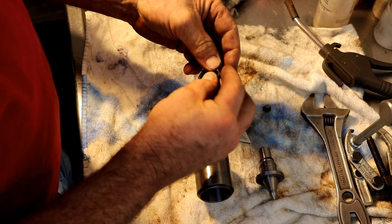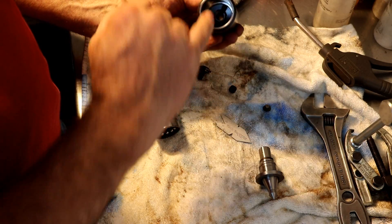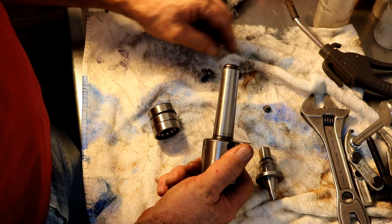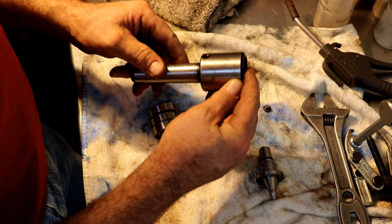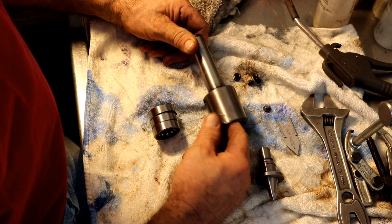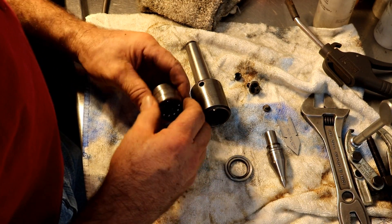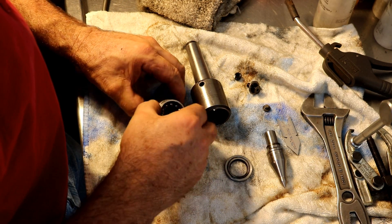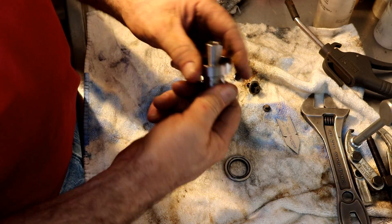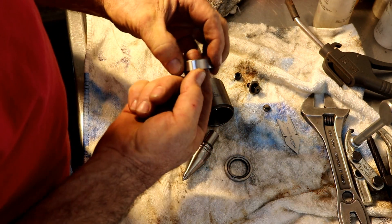The oil was probably leaking out — that's probably why there's Teflon tape on there. This is an oil-filled unit and there's a hole all the way through, so the oil could easily leak out of that plug. We'll put Teflon tape back on there. It's a Royal center — pretty simple, very nice. I got it on eBay through a make-an-offer and they took my offer, pretty decent. The bearings I cleaned up are in fairly good shape really. We're just going to slip these back on — they might need a little persuasion. They're in a plastic cage of some sort.